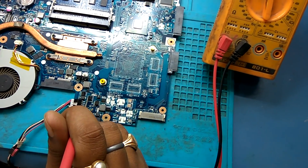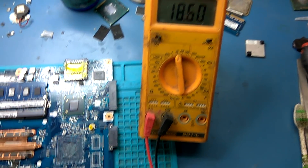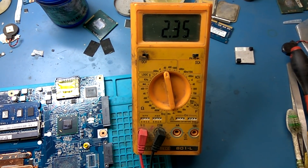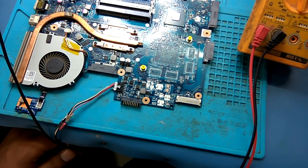The second MOSFET input is 18.60, and the gate voltage is also the same. And the output — output voltage is 2.4, 2.3 — it's unable to switch. The MOSFET is unable to switch this voltage.